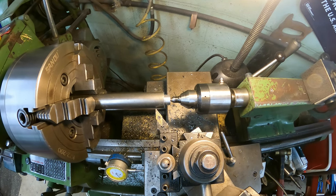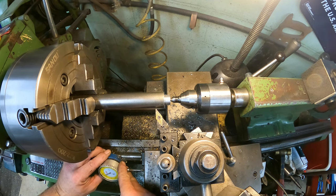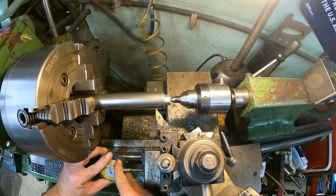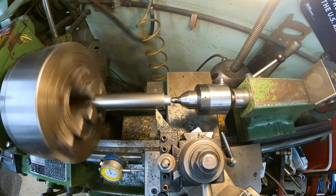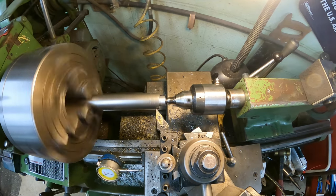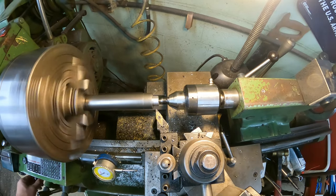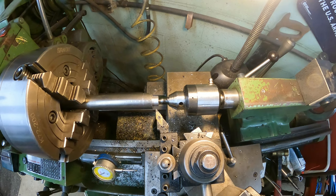1, 2, 3, 4, 5, and then 42. So we stepped off to 542 thousandths, and we're going to reset this back at zero again. I'm going to do the same thing: we're going to start up and make a line. All that is to give it a visual. Sometimes it just helps you. Then we'll scratch off just like there and set our zero down here. We only need one turn of the dial on this to get us to the 0.75.